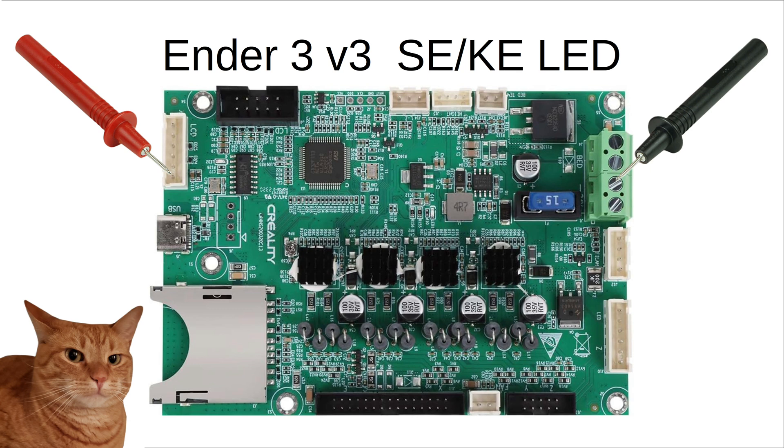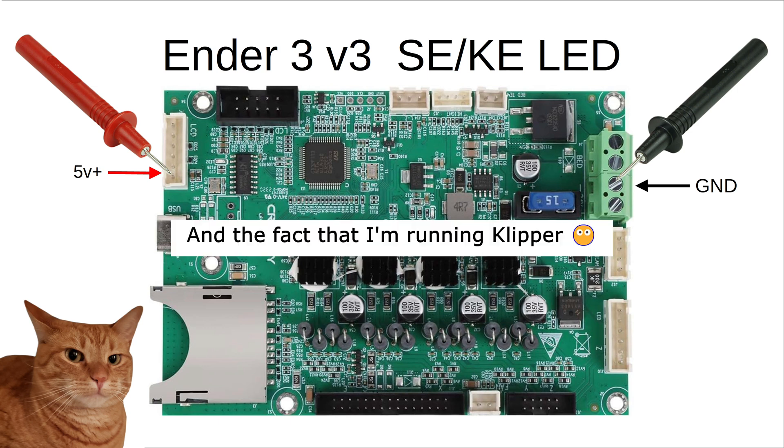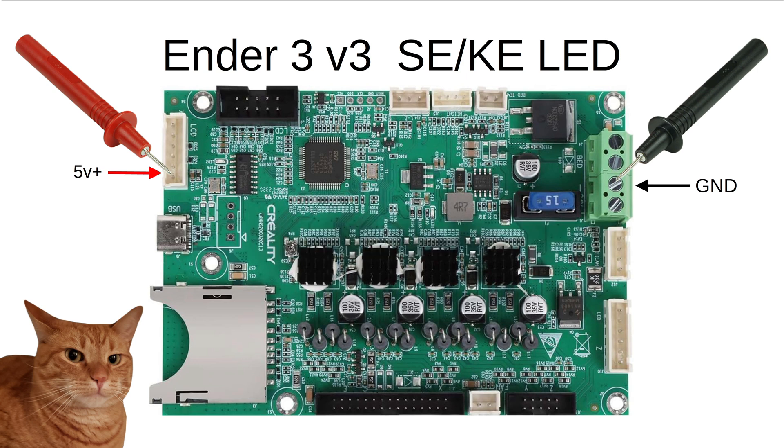Now let's look at how I was able to connect a relay to the board of the Ender-3 V3 SE. Using my multimeter, I put a black probe on the ground lug of the incoming 24-volt power, and then simply probed each pin of the LCD section of the board until I found a 5-volt constant power. This LCD socket does not get used because there is another socket feeding the power and communication of the original control screen. From this point, I needed to find a source for ground and signal from the pins on the LED section of the board. Finding ground was easy — I selected the continuity mode of my multimeter, turned the machine off, and probed pins until I found the ground pin. Then I turned the machine back on, set up an output in Klipper with the PC0 pin listed in the open source schematic, and used KlipperScreen to toggle the state of the output on and off while testing all of the pins on this socket with the output in both the on and off state. Once I found the pin that changed state along with the output status in Klipper, I knew I had everything I needed.